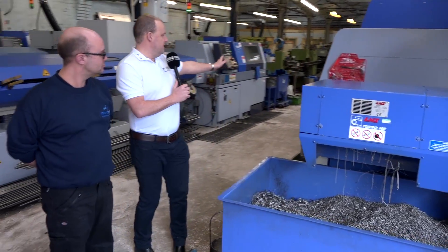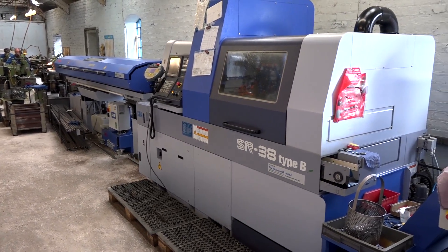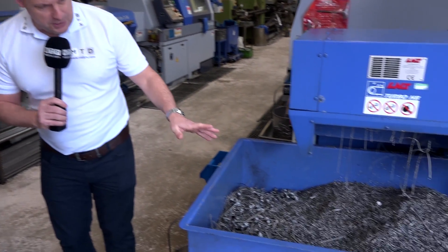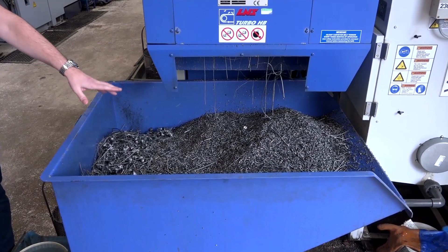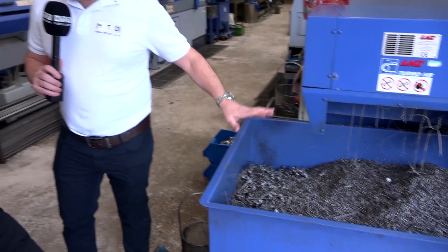Now here, Adam — this particular model is the SR38 Type-B. This is one of your latest purchases. When did you buy this? We bought this in December 2016. Why did you actually buy this machine? It's quite a sophisticated multi-tasking sliding head, isn't it? Yes — extra capacity bar size-wise and all the driven tools you can get on this machine, plus the angled milling and drilling. We do still have some stringier swarf on here, but we've also got swarf where you've been using the HFT software. Just tell us what the difference is and why we've got one and the other.